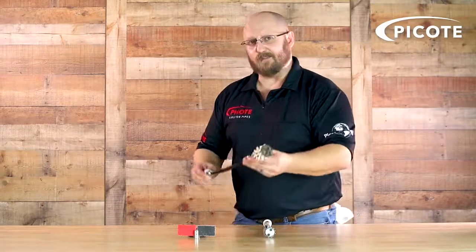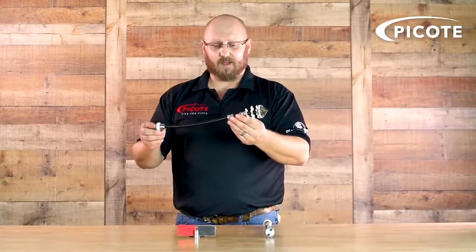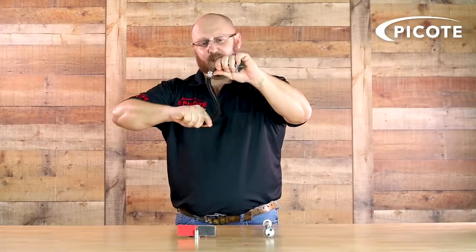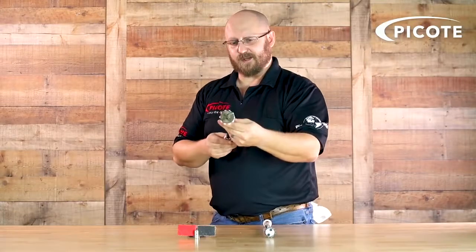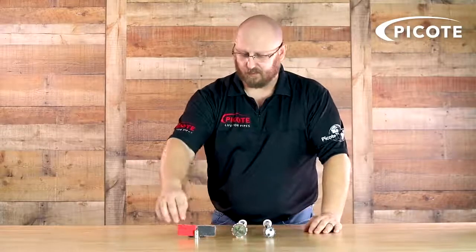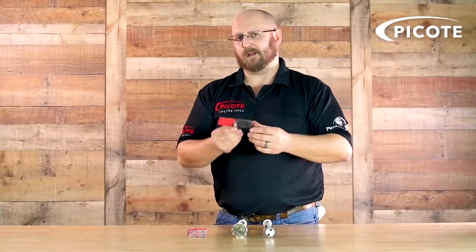When it comes to reinstatement, especially through a 2-inch P-trap, we've got the new Twister Flexi for 2-inch. It's a highly flexible cable and casing. We'll navigate right around a 2-inch P-trap to do a 2-inch reinstatement in CIPP liners. After the reinstatement with the Twister, of course, we'll want to grind that opening completely open, and for that we use our smart cutter hub.